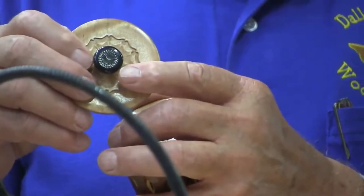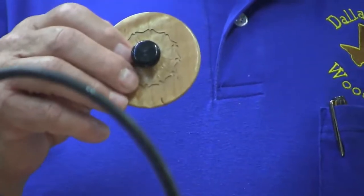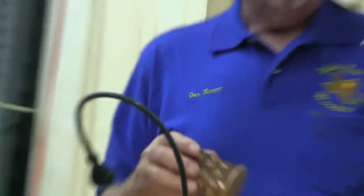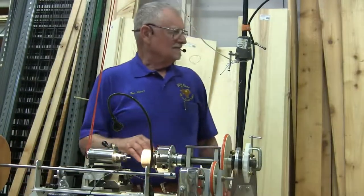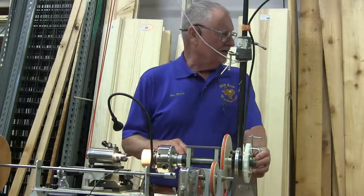There you see it. And that was cut with that same cutter in a 24-bump rosette. So the rosettes will do quite a bit of different things, and especially when you throw in different radius rubbers, it changes your cut, because the rubber is not going all the way to the bottom of the valley of the rosette. The rubber and the rosette, yes.